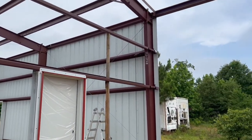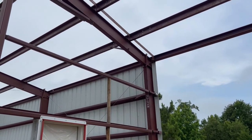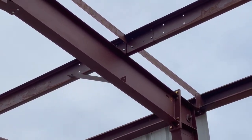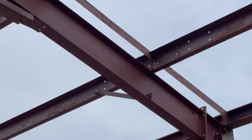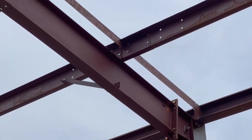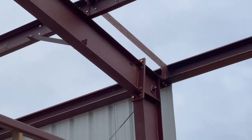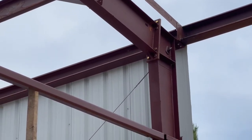And the challenge we've got on this one, which is going to be a major challenge, is the purlins run through the wall. You can see up there where those purlins are. Now we've got the rake angles welded on there so that's our screw surface, that line along the top there. But each one of these pieces of tin that goes up where there's a purlin, we've got to cut just right so that we can wrap it around that purlin just as close as we possibly can. So that's going to be a little work to figure out and develop our processes.